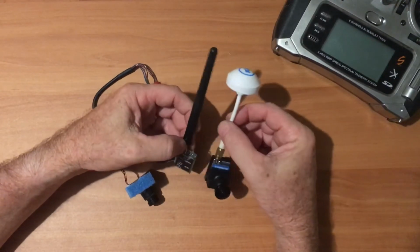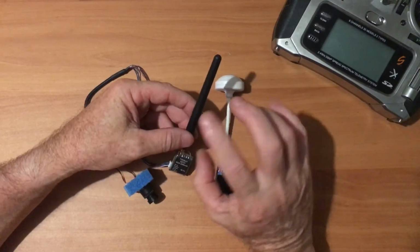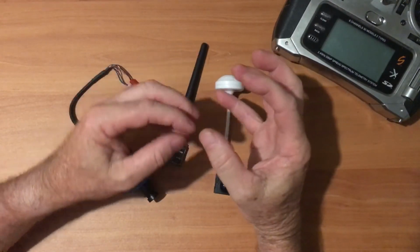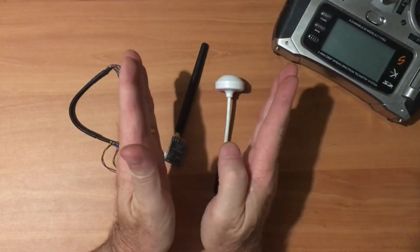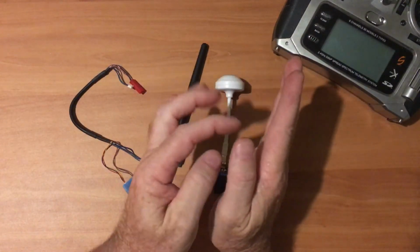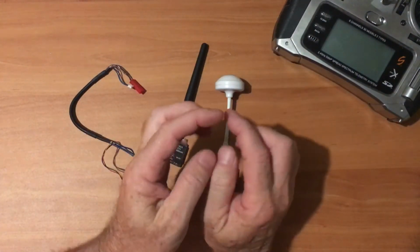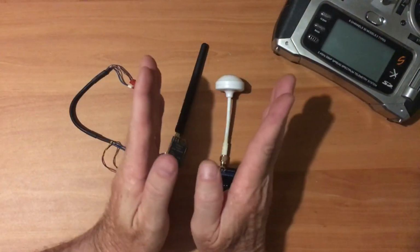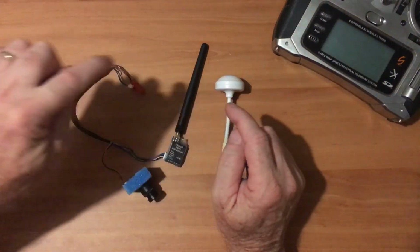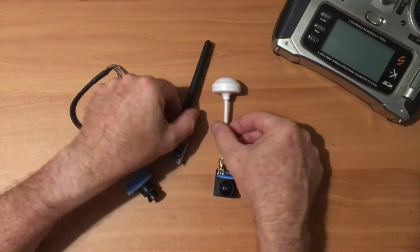You can get high gain antennas, such as a satellite dish or a patch antenna, which points to a certain area, like a dish does, and so the gain goes out there in a cone, like a funnel. So the aircraft flies within that funnel. You can actually have this on your ground station. You can actually project further passively. It's like a hearing aid that's projecting outwards. But if you fly outside of that cone, you'll lose gain. Around the back of the ground station, you'll get nothing.